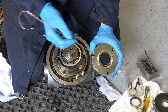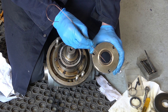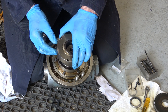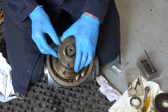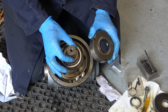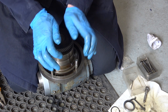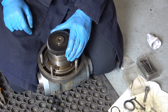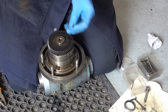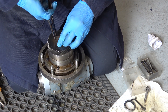In case you're interested, this seal is marked CR13534 USA. I'm going to put a piece of paper or something around here before I fit it, because this edge is very sharp. There's a little bit of play in that key but it's not too bad. Once I've put this ring on, the back section and front section here will be done.